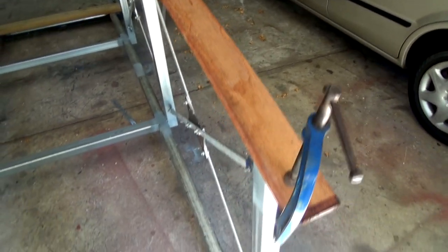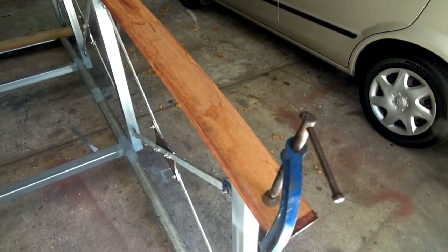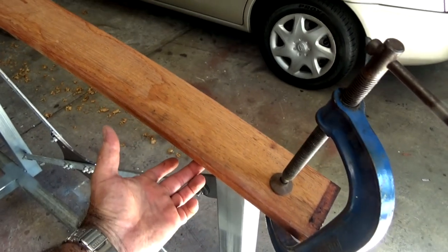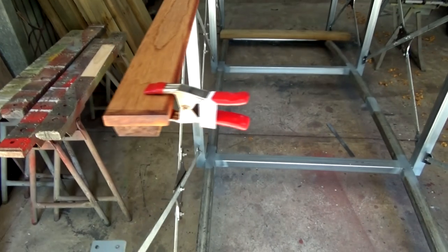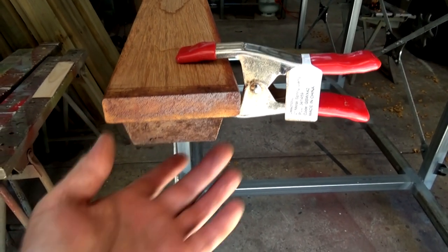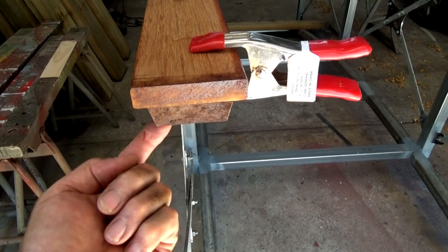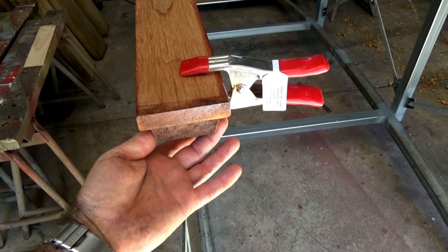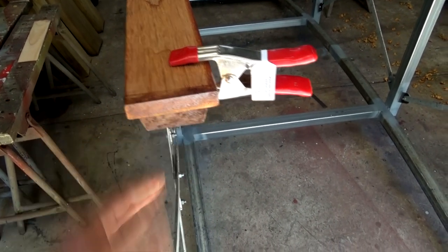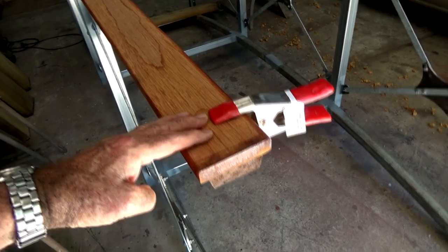It's sold as being moderately durable, and I think in this application — being up out of the wet and not close to the ground — it should be fine, as long as I keep the paint up to it. Here's one piece that's been clamped down to the top of the stanchions and it's taking that curve quite easily. I need to transfer the hole positions in the mounting plates to the underside of that board and pre-drill for the screws so there's no chance of splitting it. The actual handrail is going to be laminated from two thicknesses of that material. The bottom one has been machined to a 15-degree angle on both edges and it's 60mm wide across that bottom face. The plates are 15mm wide so there'll be a little bit of overhang on both sides. I'm going to get the other one sawn and cleaned up, and then we can get the first pair held down with screws. When they're in place, we can bond the top board with some epoxy resin boat-building glue.